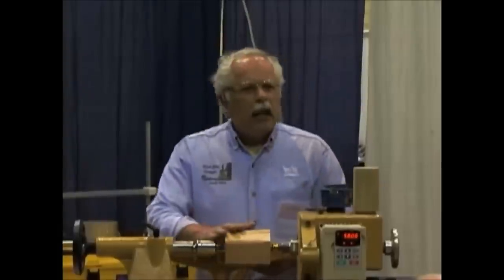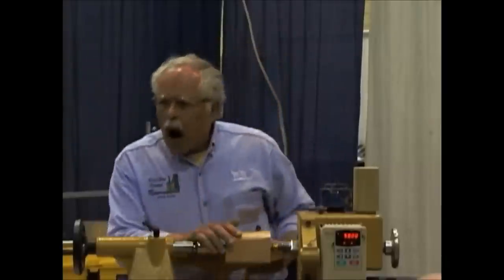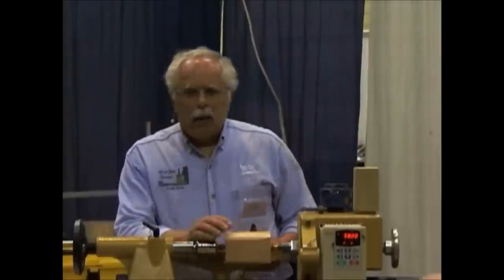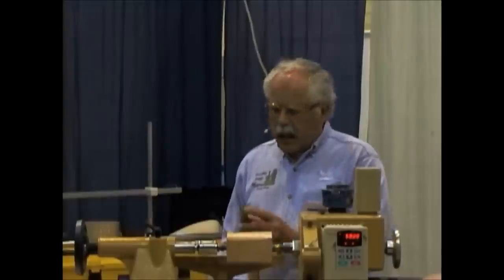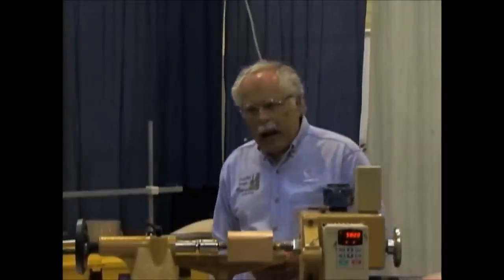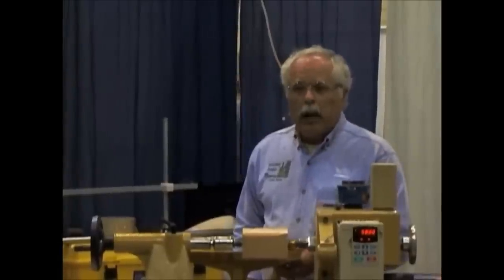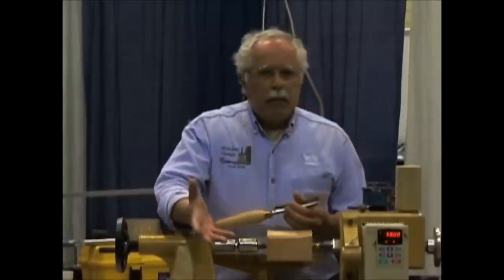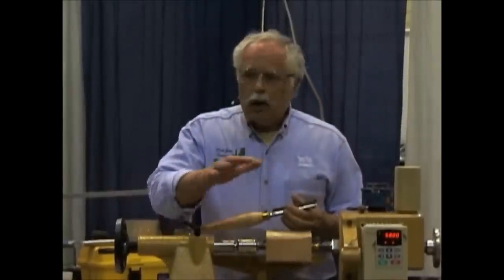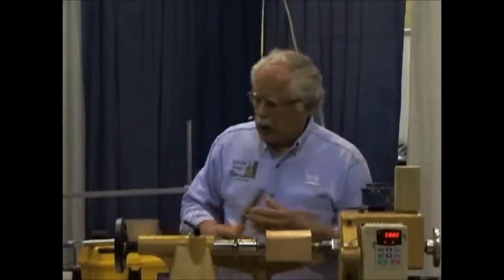The key thing I find with a lot of audiences is not explaining just how you're doing something, but what they really want to know is why you're doing it that way. So when I do this, I would have this drop way down here, and I rough out like this because I have a 25-degree grind usually, and I come at it, and that's why I use this particular spindle gouge, how I can turn and rough this out, etc. And they want to know why. Why are you doing that? Why are you not using a roughing gouge? What's the difference? That's what I explain to them. That's what I'm sharing with them. I'm not talking down to them, not saying you've got to get rid of your roughing gouges. I'm just saying, here's how I do it and why I do it.